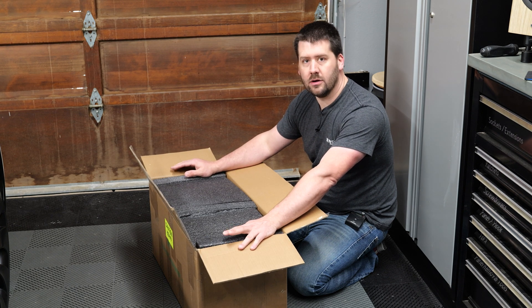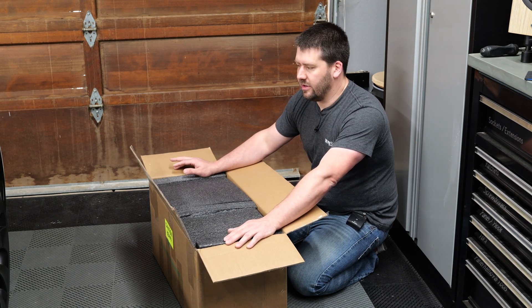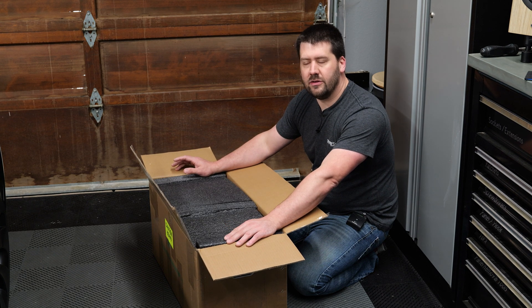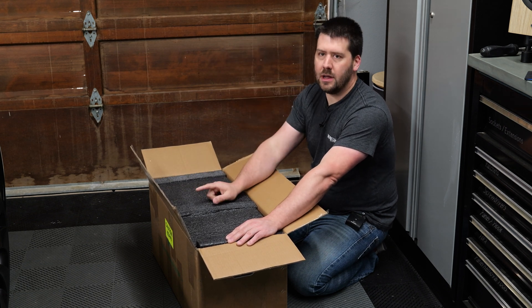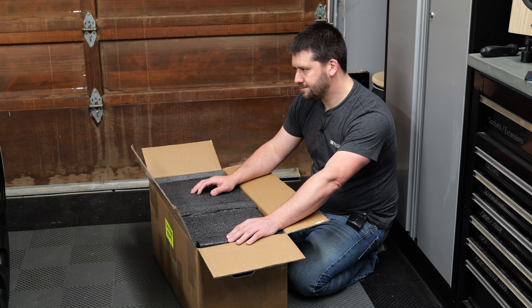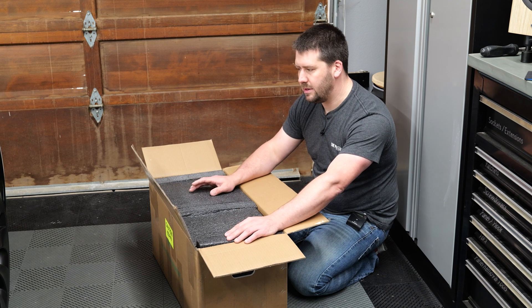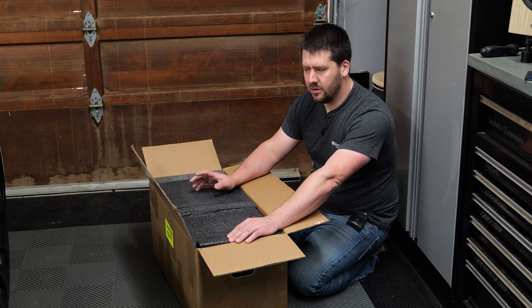Like many other people who bought a K1322 or any other larger pressure washer — AR630, Active 2.3, etc. — I installed a dedicated 20-amp receptacle inside my garage specifically for that pressure washer. My panel is over there, and there's a piece of 12-gauge wire that runs from the panel directly into a single receptacle. That pressure washer is about 1.8 gallons per minute at about 1100 PSI — tested by many people, that's about the result it gets.